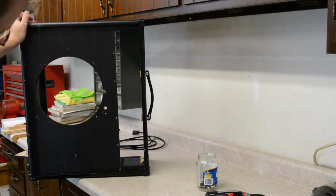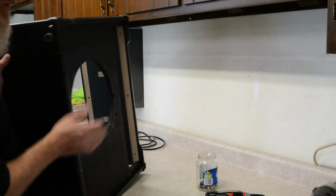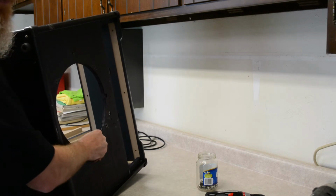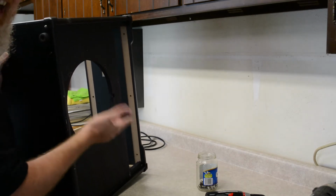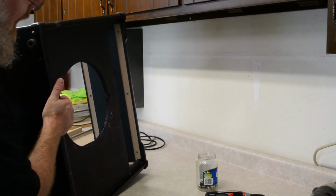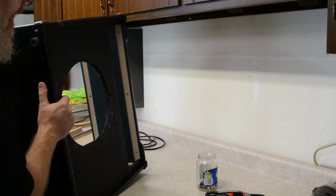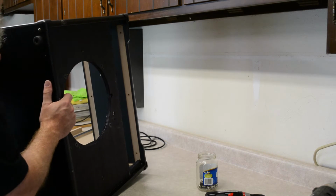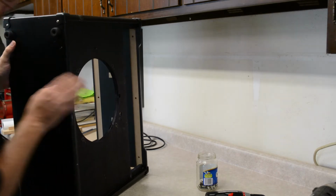So do you think that's stripped down enough to clean? I don't know. This is plywood. The baffle is plywood, so I can say you do want a plywood baffle. I think it is actually less dense and more flexible than MDF, and you want that in a guitar amp. Most speakers, like home audio speakers, MDF is better because it is way more dense. It doesn't leak air. It's not as flexible, so you can make a nicer airtight cabinet. The only drawback with MDF is it's heavy. It is so dense, it's a lot heavier than plywood is.